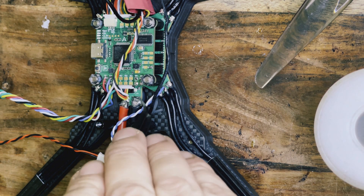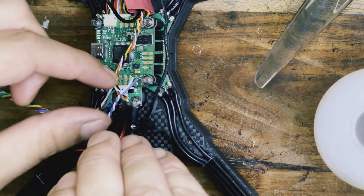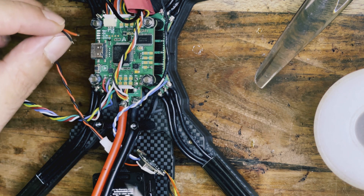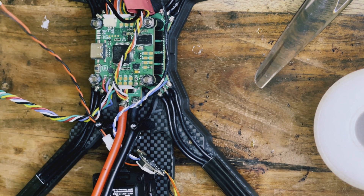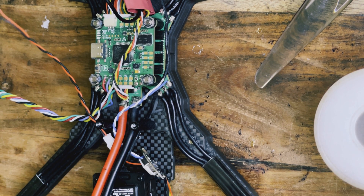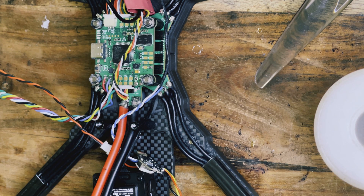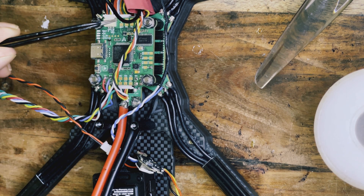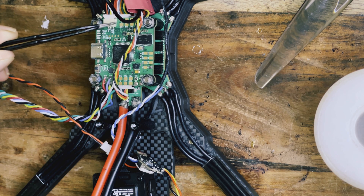Okay, now I'm gonna install the RX, TX, and the power and the ground. After that I'm gonna put the side plates back and remove props and we're gonna start to work with the lights. RX3 and TX3 and the ground over here with the VBat pads.